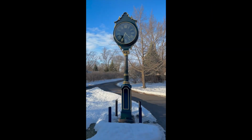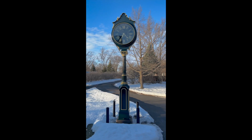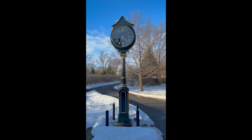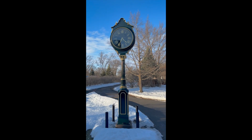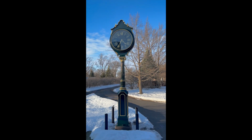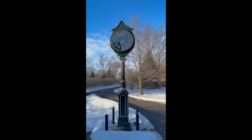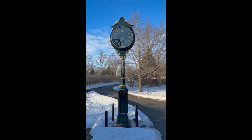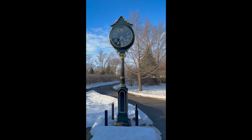As you can see from the scenery, it's been some time since our last video clip here. Part of that was a busy fall on my part, and part of that was wanting to see how the clock actually runs over some time. The good news is it keeps absolutely fantastic time. The bad news is when we get below zero, I believe the choice of grease that I made at the top of the drive shaft is a little stiff for the extreme cold. So unfortunately, to solve that, I have to take a dial off, and we'll see how soon that becomes the top of my priority list.